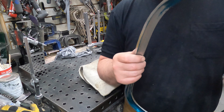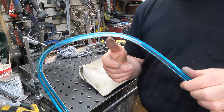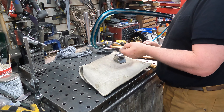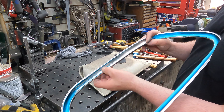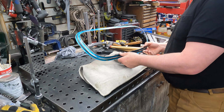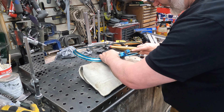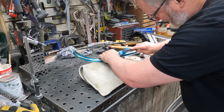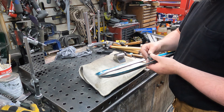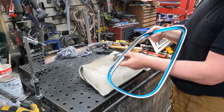I am a little bit afraid that I cut that flange a bit thin, but I did test it out with my turning device — which is a wrench — and it seemed to work okay. If you're wondering how hard the hitting is: this is very different from forming, we're now just planishing. Again, another area where the tool got away from me right in here, so this is going to take a long time. It's also on the straight — if it isn't straight there it's never going to get straight anywhere. I set it in on the dolly and I'm just moving the surface out a little bit — bending it, not stretching it. You can see it got a little better, just a few taps.